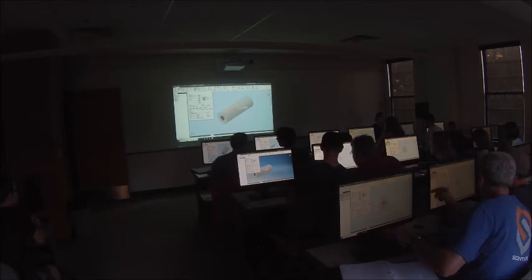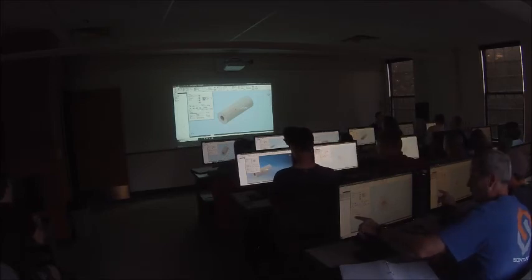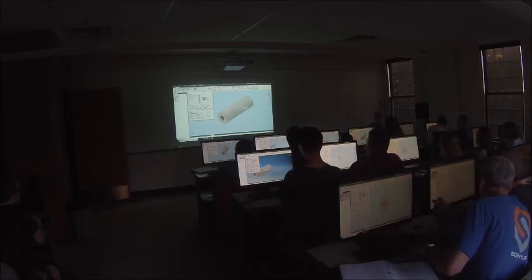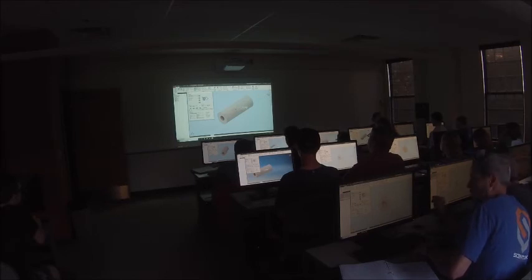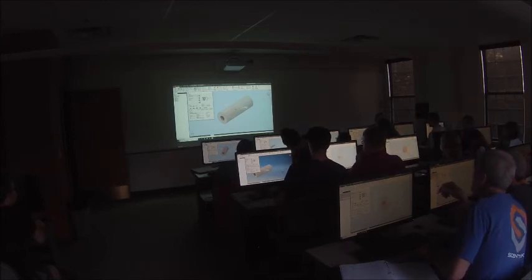Okay, it'll automatically fill in the hole depth. And basically, this is the deepest hole you can tap with a normal tap. So that's a good number because really you can't tap a threaded hole deeper than that. If it doesn't do this, you need to make sure this full depth thing is checked, because that makes the thread the full depth of the hole, because sometimes you don't want to tap the whole depth of the hole, but we do. Okay, click OK.